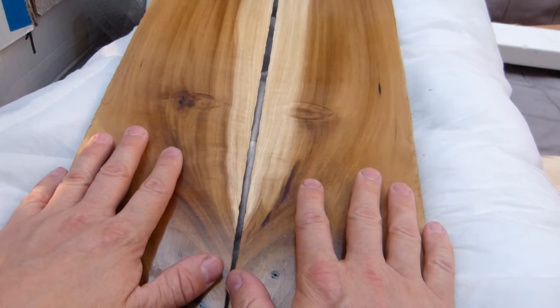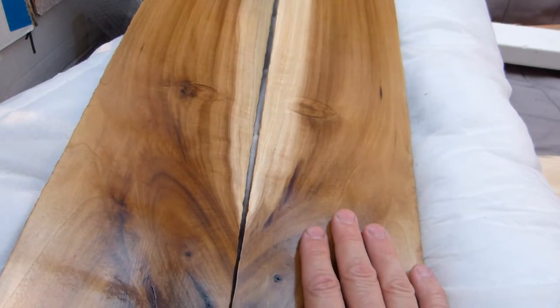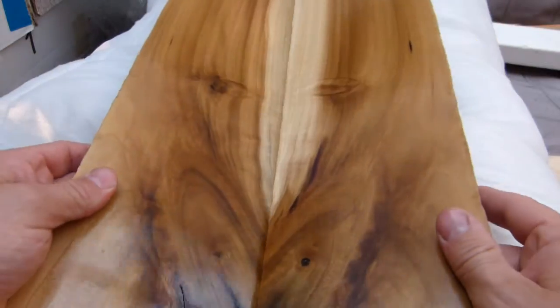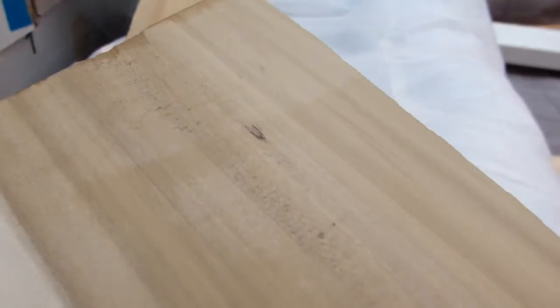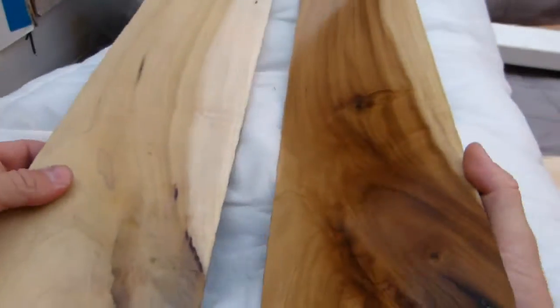Poplar is very light and very easy to work with. It is a hardwood species but one of the softest hardwoods there is — probably balsa is the softest, but this is close. When it's sawn and sanded, the grain often remains fuzzy with some grain tear-out. It needs a lot of sanding, or sanding with finer grits, to make it really nice and acceptable.